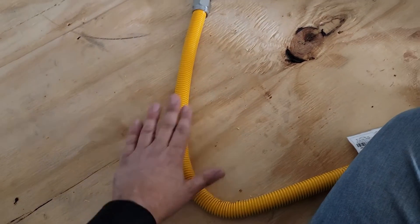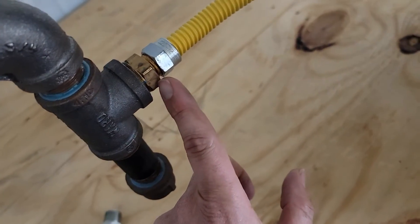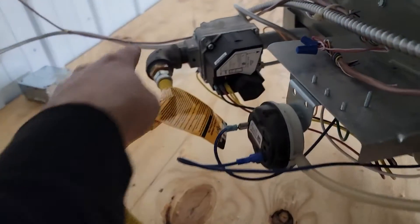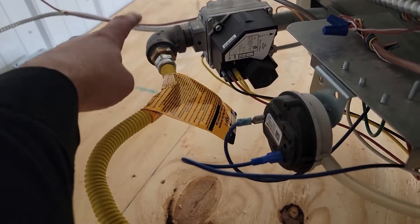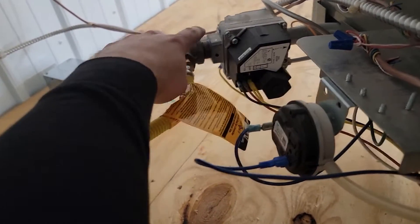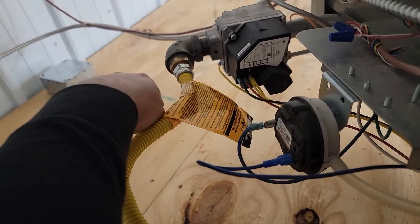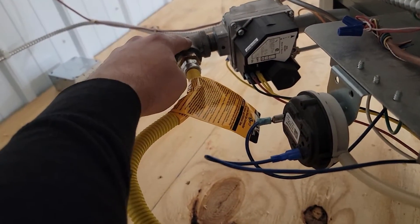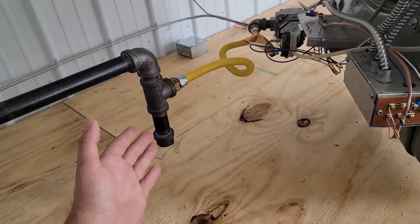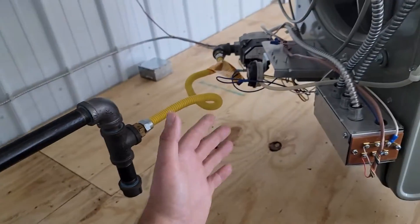We need to make sure it is the right size because we are causing this noise by having the wrong size pipe. I've got a three-quarter inch flex hose that's going to be perfect. All we've got to do is take this fitting out because this is a three-quarter by three-quarter T, and take this fitting out here because this is a three-quarter inch 90. We've also got a three-quarter inch hookup here for our gas valve. I'm going to let you hear the sound after we get this flex hose disconnected and get the right flex hose installed.